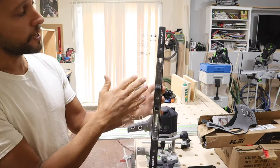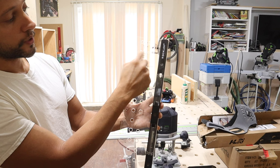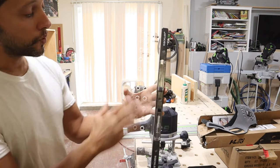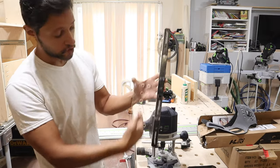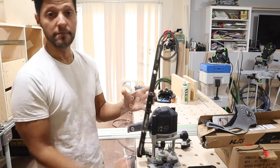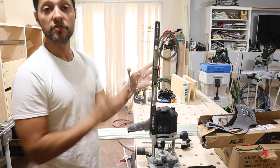With this system your indexing is for the quarter inch holes; for five millimeters you index right here. You place this inside the cabinet while it's pre-made and already assembled — you can still use this. You don't have to drill every single hole; you can select how many holes you want. You don't want your cabinet to look like Swiss cheese from top to bottom. You can't put a shelf all the way to the top or all the way to the bottom, so just take about seven holes in the middle and select those.